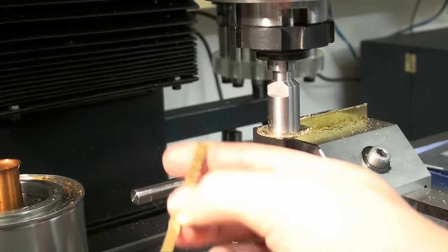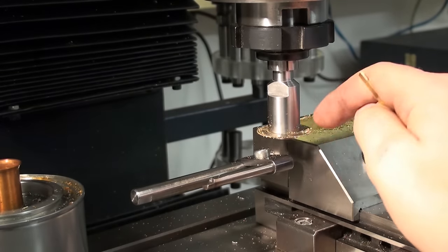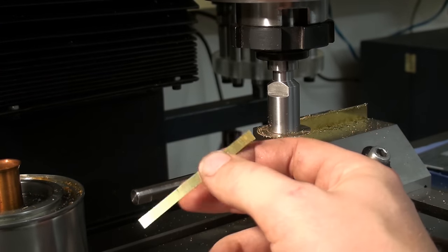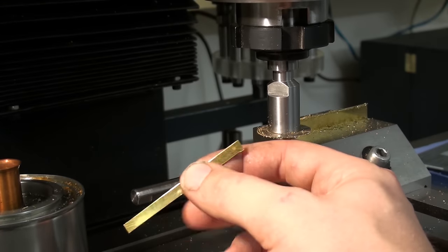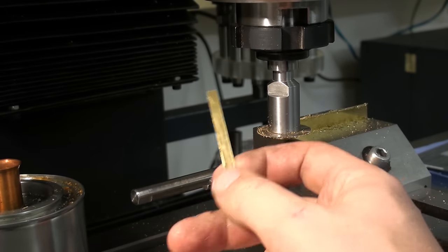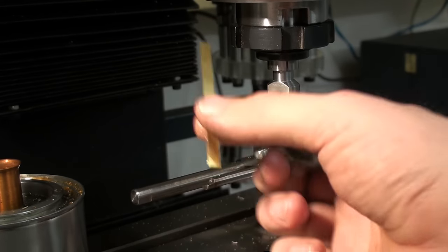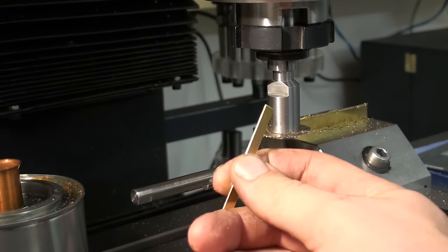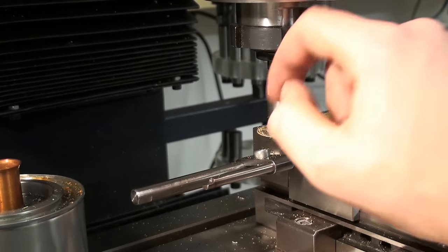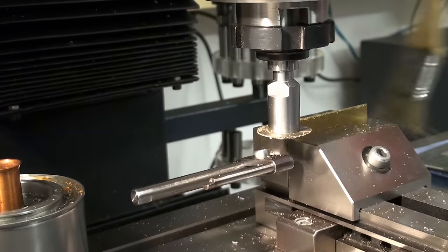So, one neat strip of sheet metal cut with the slitting saw from a piece of sheet metal. Now you can proceed and make your prototype part that later might get stamped out of a tool or something like that. But for the prototyping you need accurate material. So, I think these saw blade arbors I made are quite nice and they work like a treat.